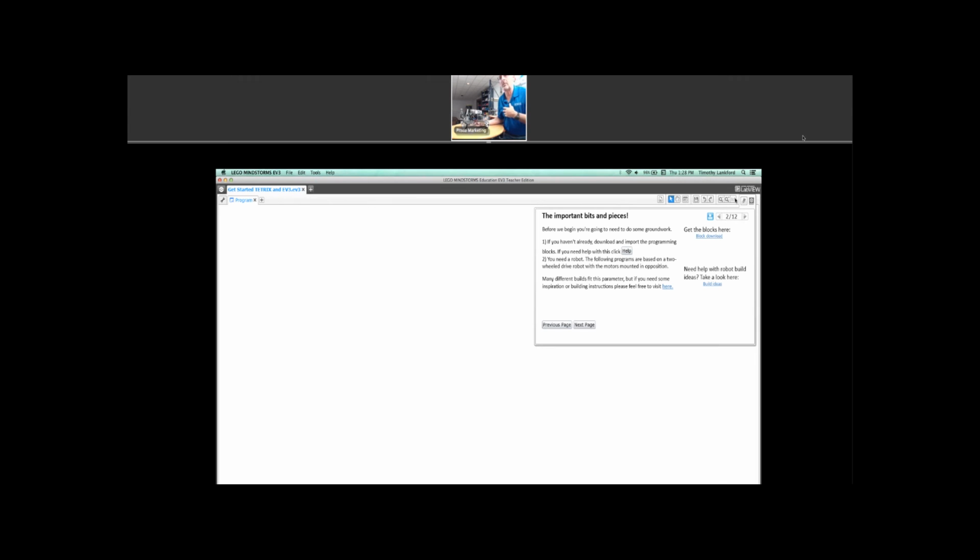You can do that on your robot by going to the actual View Port tab on the EV3. I can choose that, and I have my boxes plugged into port number 1. I don't know that you'll be able to see this in the webcam, but if it's recognizing the TETRIX sensor correctly, port number 1 will show a question mark. It doesn't know what sensor it is, but to the right of it, it says it's an I2C bus that it's looking at, and it should have a 0 information. That is telling me that I am recognizing the port correctly. Inside my project file, under the teacher notes, there is a screenshot of that so that you can see it.